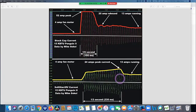Yes. And so that does not really reduce the amount of wattage or power that you need because it is actually doing half as much current for twice as long. Yes. That's the easiest way to think about that stuff. So if I wanted to, and I don't want to, I could apply the calculus. We could show that, but just trust me. It doesn't really help anything except it just assists the generators or any limited power situation, be it mooch docking or a pair of air conditioners on a 30 amp. It just assists it in getting the thing started with less of a grunt.